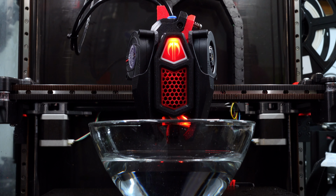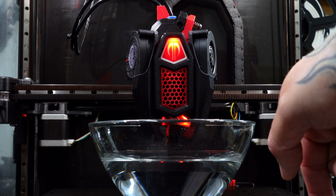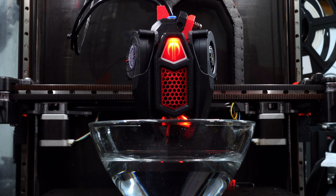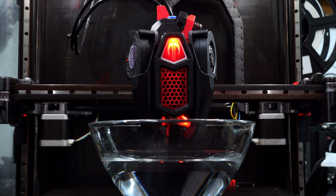Maybe update where your printer parks the tool head. I know in my print start, after I do a QGL, the printer then rehomes. So I have a line in the print start macro so that after it successfully QGLs and the tool head is here by the front idler, that it moves 50 millimeters back and then rehomes. So just a couple things to keep in mind, but overall, this is a fantastic tool head. I really want to say thank you to AP and everybody over at the Reaper design team. They've done a great job with this. Now I have a tool head that has the pre and post extruder filament sensors, which will be very useful in the projects that I'm doing with multi-material units.